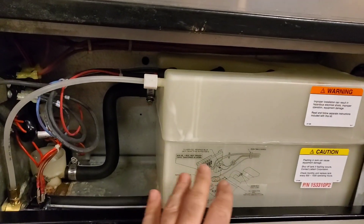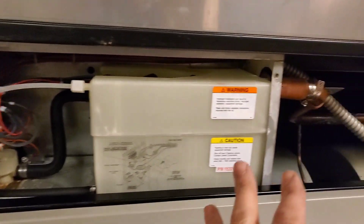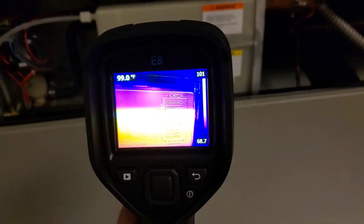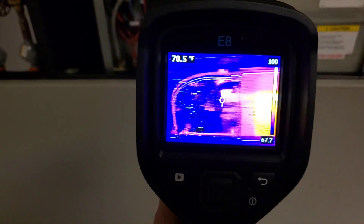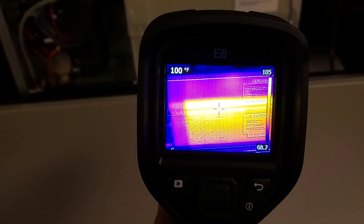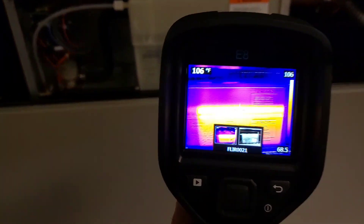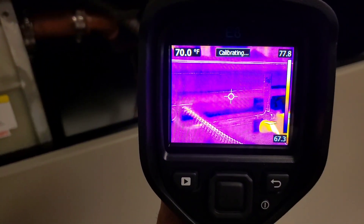What I'm gonna do is use the FLIR E8 XT to take a snapshot of this and see exactly what's happening. We have the FLIR E8 XT — this is a pre-boil snapshot — and on the tank we're at about 100 degrees Fahrenheit. We don't really see anything coming out the header just yet.